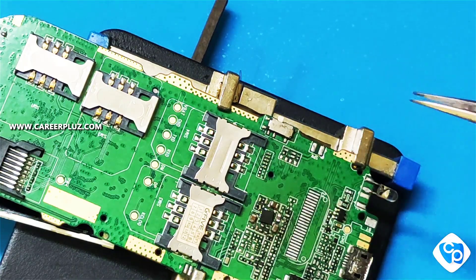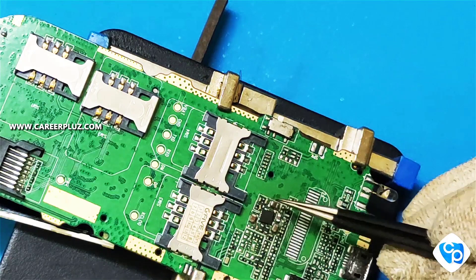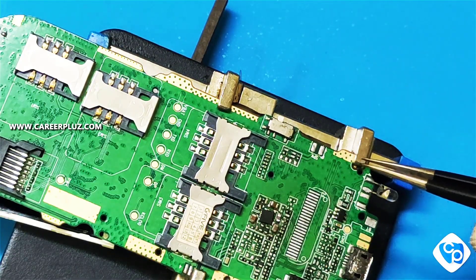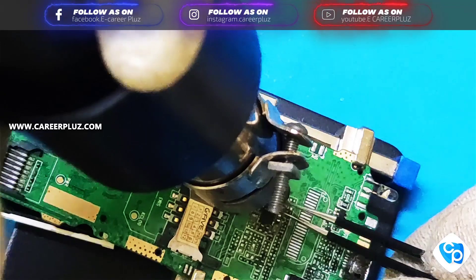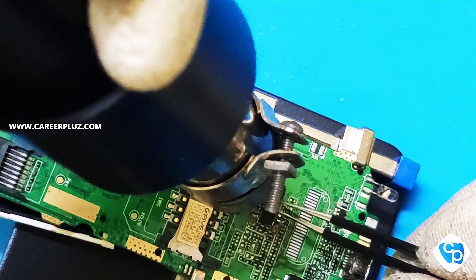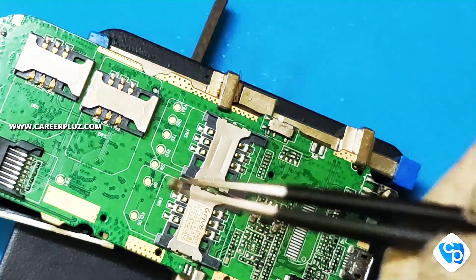It should not be melted too thoroughly; if so, we cannot fix it again. Many will use the soldering process — the soldering process will be easy, but while heating it may melt. I have fixed the air at minimum level one and the heat at a low level near the components. Wait until it melts and then remove it using the tweezer. I have now removed a capacitor.